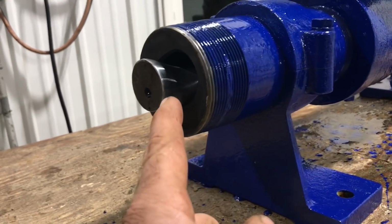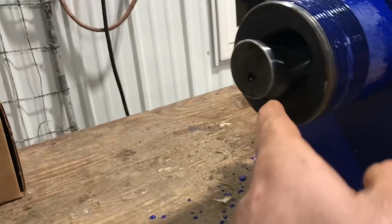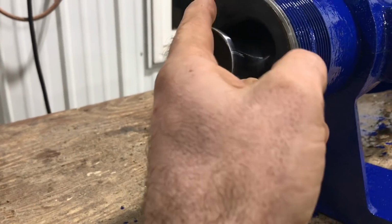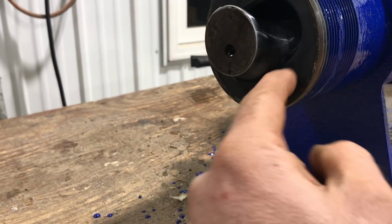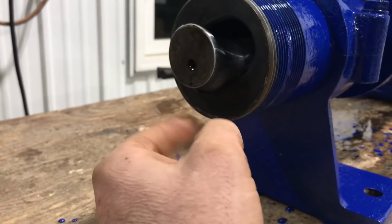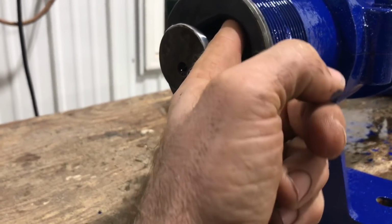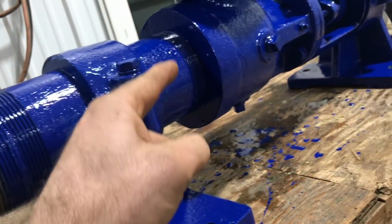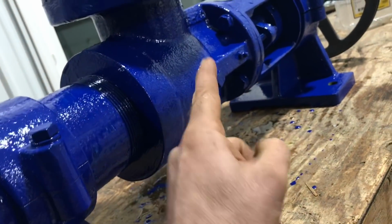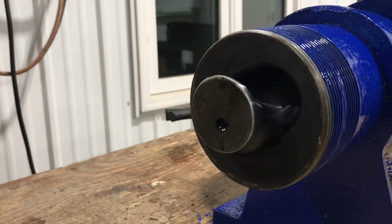You look it up on Google and you'll see a bunch of diagrams and such. But basically, it's kind of like a worm gear that goes through and works itself within the stator. So this is the rotor and this is the stator. And as it's offset and works around like that, it opens up a cavity and just progressively, very passively pushes it along around and up and then forces it up through my honey hose.